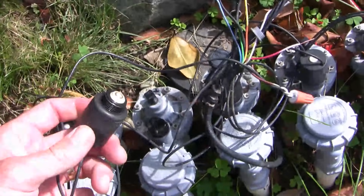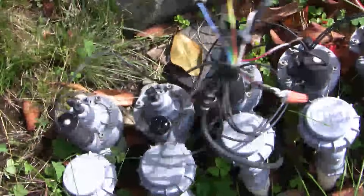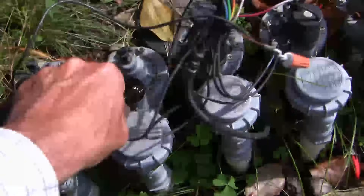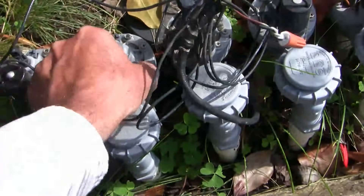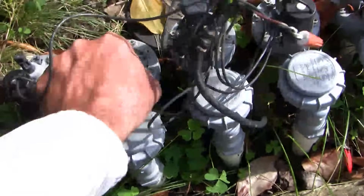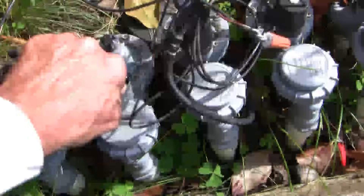If you don't want water everywhere, remember to turn off the water before doing this step. Unscrew the solenoid, then slide off the manual control arm and unscrew the bushing. If you don't have access to a DVM, the alternate way to test the solenoid is to swap a known good device for a bad one. If you do that you need to swap the wires as well in case the problem is with the wiring.